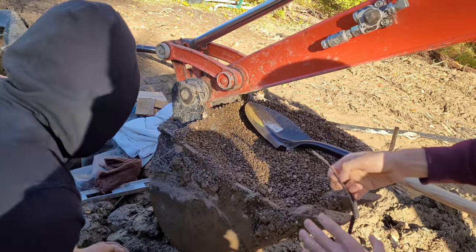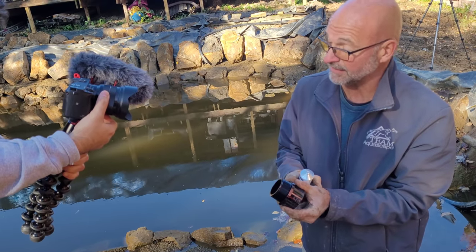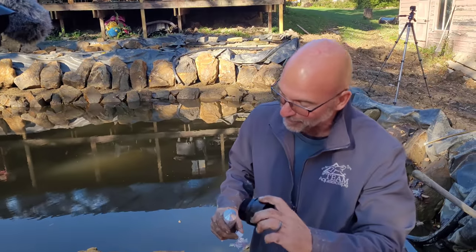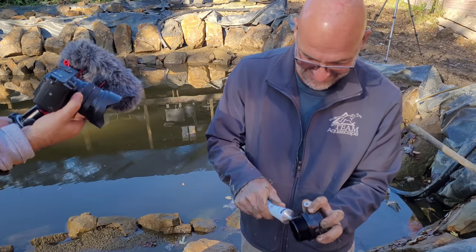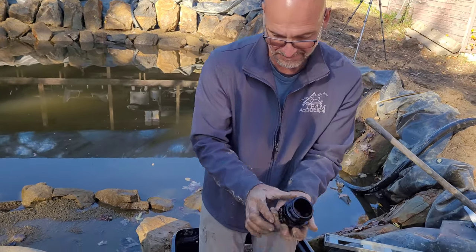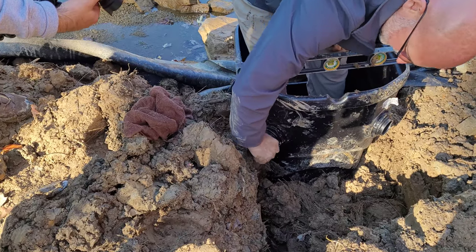About to get serious around here. The more you screw it in, the tighter and tighter it gets, which is really good — creates a nice tight fitting. But the problem is if you overdo it, it's almost like putting a wedge into a log. You will break this fitting. It won't crack, it'll pop that and ruin your day because then you've got to pull everything apart. So you want to go hand tight and then maybe one turn past that — that's it. I see this has happened to you before. It definitely has. So we get a little silicone on here — it'll lubricate everything and create a nice seal. You could use pipe dope or pipe compound, whatever you desire, but I like to use silicone. Works out very well. I love learning from other people who have already made the mistake — you make a mistake, you don't do it again.